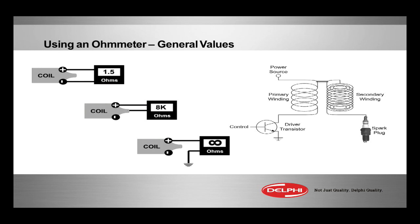Now, a little 'tester beware' warning. I'll talk about this more in the hands-on bench portion. There are sometimes a replacement of that little jumper between the primary and the secondary with a diode — sometimes a Zener diode that takes, let's say, 70 volts to jump across. Therefore, you may see resistance of several thousand ohms when you move your meter one way, then reverse the leads and you see OL, or you just don't see anything.